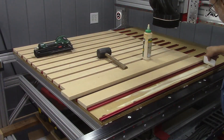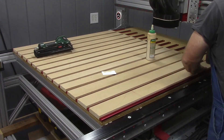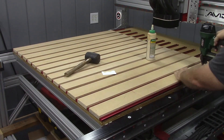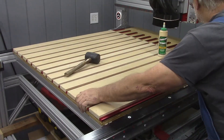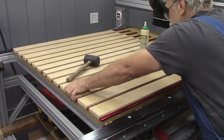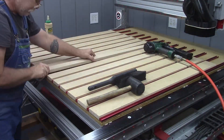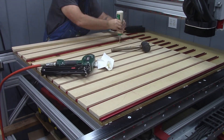I started using a piece of junk mail as a glue spreader, but after a couple of attempts I gave up on that idea and just spread the glue using the bottle. I fastened the MDF strips down with my Omer composite nailer, tried to get everything lined up with the front of the table, and then off-camera straight-edged the front of the spoil board with my half-inch down cut bit.